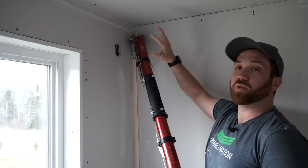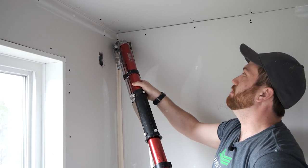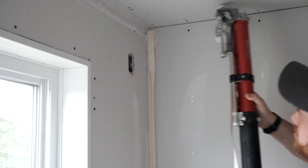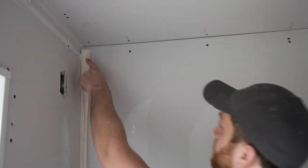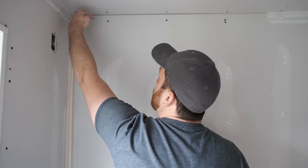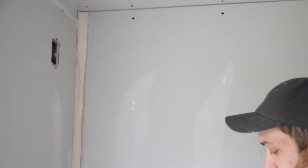Now about three inches away from the ceiling — that's probably where you want to be to make that cut. I'll pull down to make that cut, and as I pull my taper away and continue rolling with that creaser wheel, you can see just how close we are to that top angle. If you happen to cut your tape a little short — say a half inch from the ceiling — that's acceptable. You can also just pull up on your tape a little bit to raise it closer to the ceiling, so any gap at the bottom will be hidden by the baseboard.